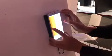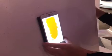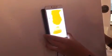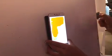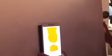Different modes are going to tell you different information. Here we have expert mode, which is just the sensor's raw data. You can use it to pick up piping and wiring that's curved in your wall. Here you see the pipe is curved and you're actually tracing it with this mode. This mode can also be used to detect movement in your wall if you have rodents or termite nests — it will show up like this. I'm using my hand as a demonstration.